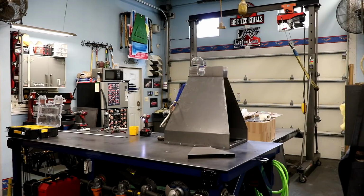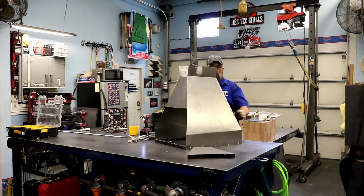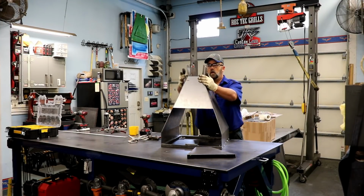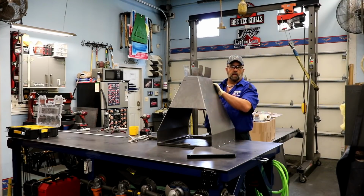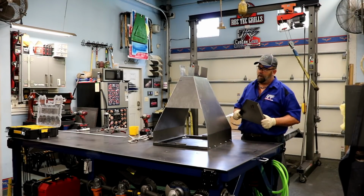All right. Now you can see you have one A-frame temporarily installed where you want it. You got your opening at the top, at the bottom, at your 4 7/8, which is exactly what you want. And then you'll do the other end the same way. So I'm going to go ahead and get this other one in, and we'll be back in just a minute.